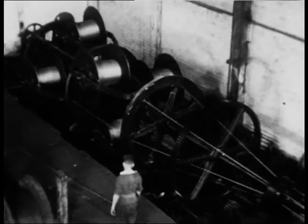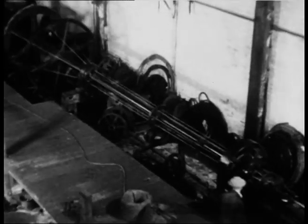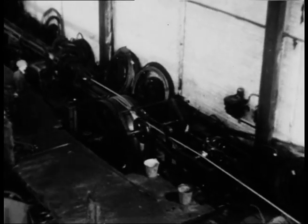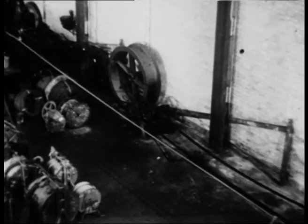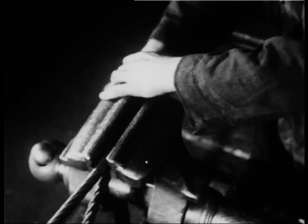This closing machine has a capacity of 20-odd tons. This rope, coming onto the closing reel, is 4.5 inches in circumference, made up of 6 strands of 19 wires each of galvanized quality. From the closing machine, the rope goes on to have its desired fittings attached by splicing. In this case, the required fitting is a thimble splice.